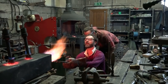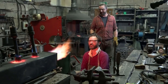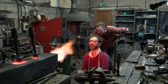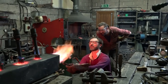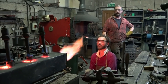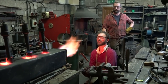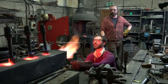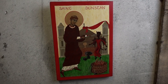It's so soft! This time, we heat the sword hot enough such that the carbon in it goes into solution, and then we quench it and cool it so fast that the carbon doesn't have time to come out of the solution and form pearlite. Instead, it stays in the steel and hardens it. The outside of the sword cools fastest and goes hardest. If you were to cool it too fast by, for instance, dunking it in water, then the whole thing would go brittle right the way through. St. Dunstan, patron saint of smiths, do not fail me now.